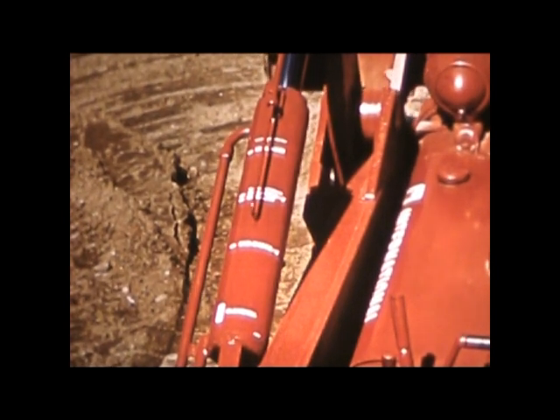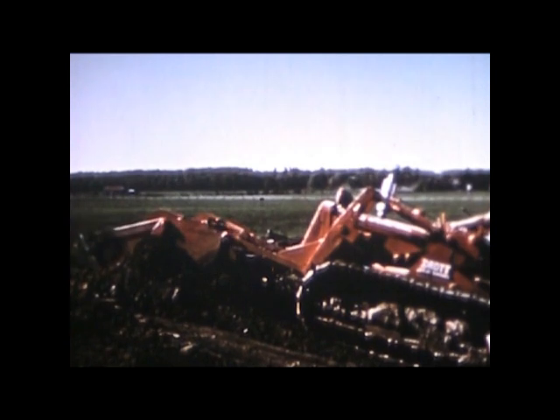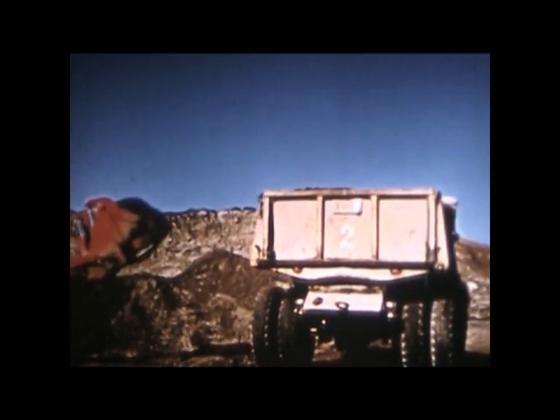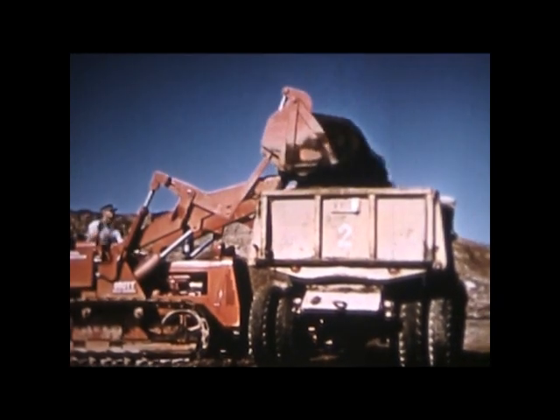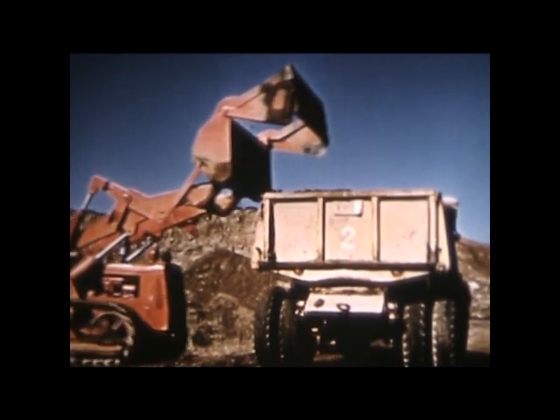When you move the indicator clear down to the clamshell position, you've got a hydraulically powered clamshell bucket for picking up loose loads. Plus the rollback and low-carry semi-skid transport with a higher lift for dumping than you may have ever seen before. Bottom-dumping this clamshell gives you up to three feet more height in the clear for the bigger, higher trucks, even with sideboards they're using these days.